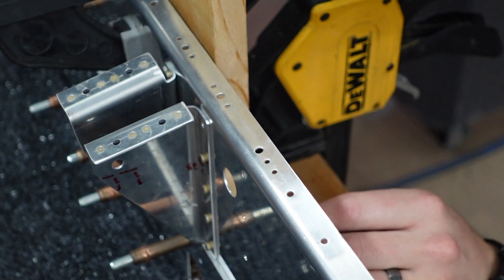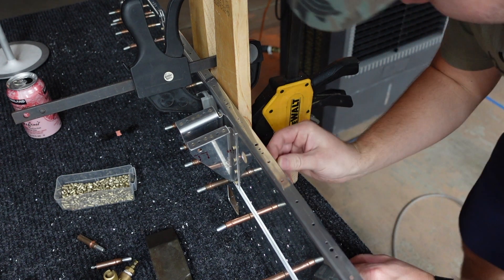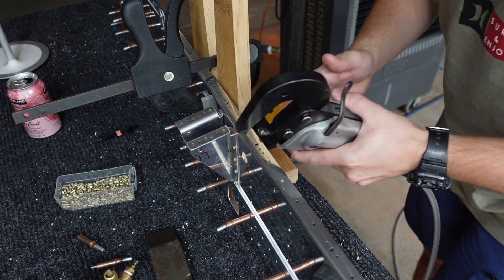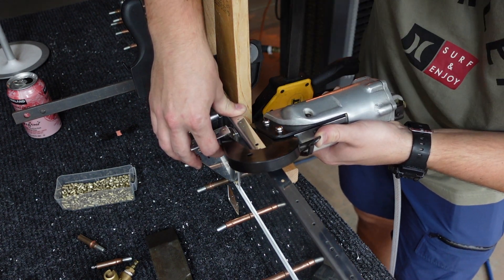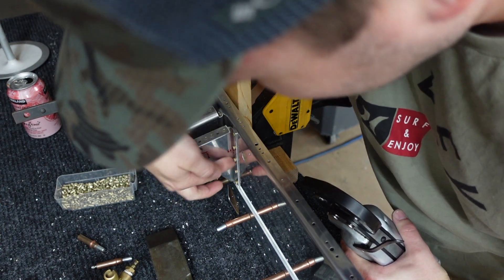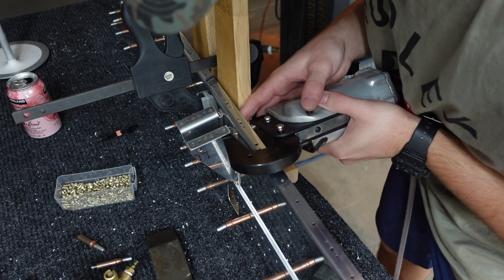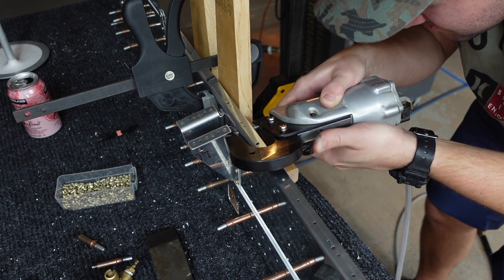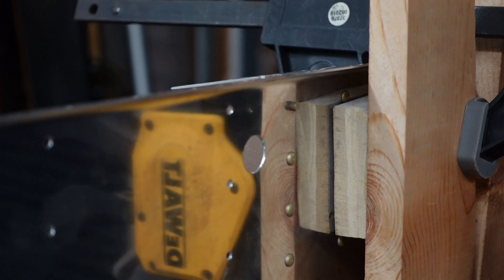No oblong hole or anything — the hole has been preserved, good to put a new one in. Here I am after dinner. I thought long and hard about it and I was way overcomplicating things. I don't need to buck this top one — I'm fairly certain I can squeeze it. That will be a whole lot easier than trying to get fancy. I think this should work flipping it around and going the other direction. It's going to bother me having all these shop heads on one side and then this last one flipped the other way, but it does not matter — it's strictly cosmetic. Bring it around to the other side, adjust the rivet squeezer, and give it one more ca-chunk and we should be there.